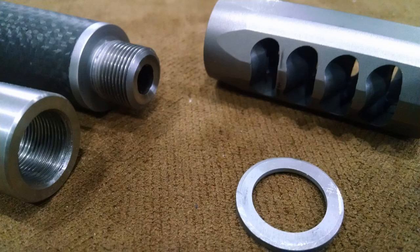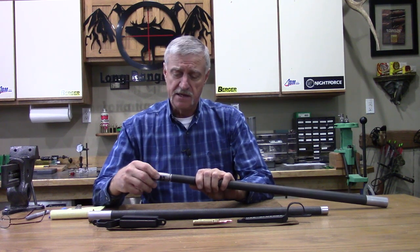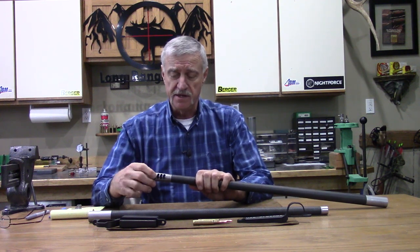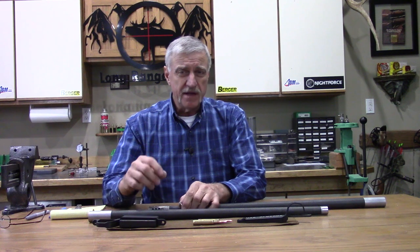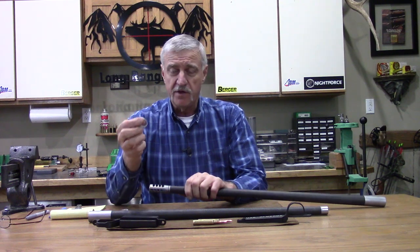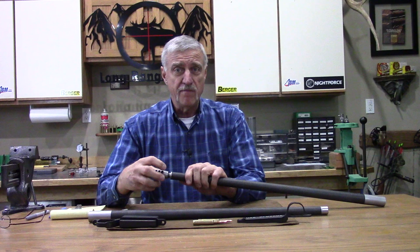Here's the brake we're going to be using — the Christensen Arms Slayer brake with adjustable top ports, and you can screw that right on. Now it's going to have to be indexed since this is a side-discharge brake. You've got a couple of options: I have the luxury of a lathe, or the gunsmith building this rifle will take fine cuts off the back until it indexes straight up. Christensen Arms also includes a crush washer with the brake — it has a slight concave to it giving you a little variance as you tighten up to index on top. You won't have to expend the expense of threading for your muzzle brake, and if you don't want to run the brake, put the thread protector on and you're good to go.